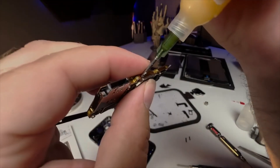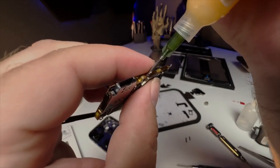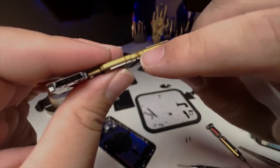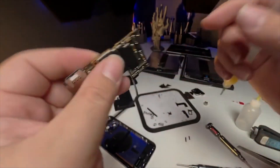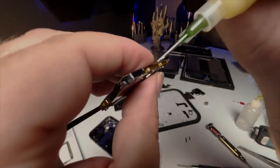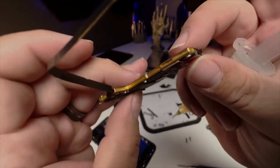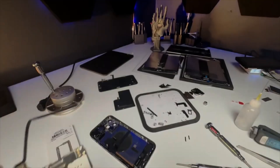Adding a little flux around the perimeter — not overdoing it — will definitely help with this process. It prevents the solder from oxidizing too much, allowing things to flow in a more lubricated fashion and making it easier to separate the sandwich boards.